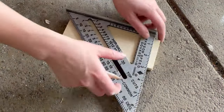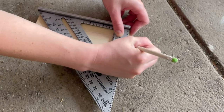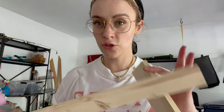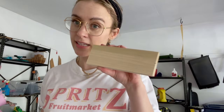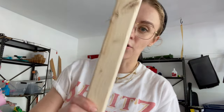Next, figure out where the center of your 7-inch piece is, as well as each of the mitered ends of the legs. So with the 2x2 leg that you cut to 20 inches, you're going to cut one end at 10 degrees — only do one end. Then you'll take the 7-inch piece that you cut and line them up so that it goes at an angle.